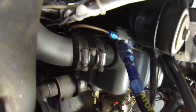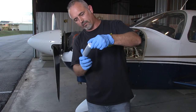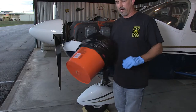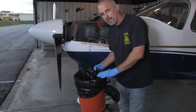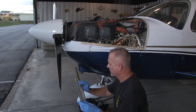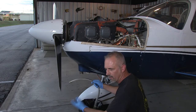What you do is basically push the valve up, twist it a little bit, and it'll release oil. We're going to go ahead and take our sample — hopefully without making a huge mess. We've got our oil sample; that's the first thing that comes out and it's got to come fresh straight out of the engine. We've got a five-gallon bucket with a bag inside to keep it clean and reduce cleanup. I made a piece of tubing with some straight aluminum zip-tied on so it stays straight in the bucket and doesn't coil up or let oil overflow.